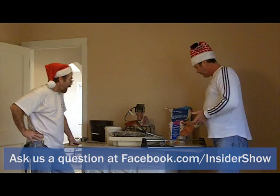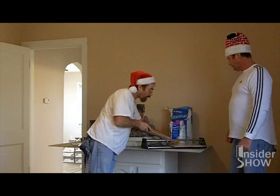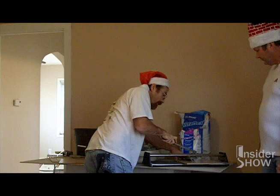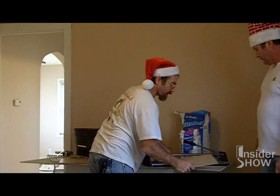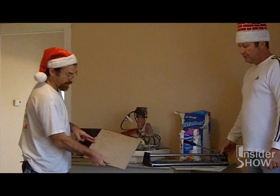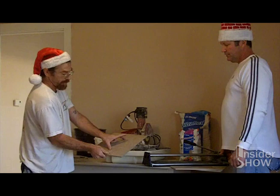This is your all-purpose tile cutter — it's a slide cutter. There's a bracket here where you can set your measurement for how wide your cut is. Get it in, make sure it's square against the back piece. With firm pressure, slide forward, pop it one time with the handle, and now you have your two cuts. It just scores it at the top and breaks the sheen, the finish. The way the handle is made, it puts pressure on both sides of the score line and that's what snaps it.